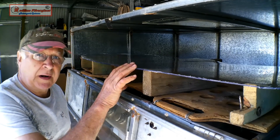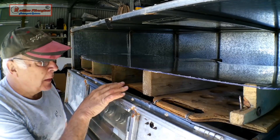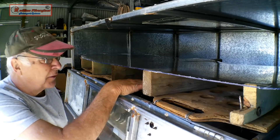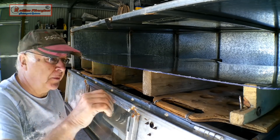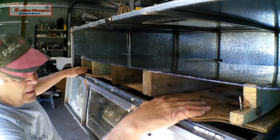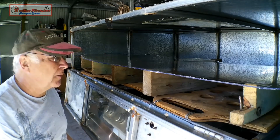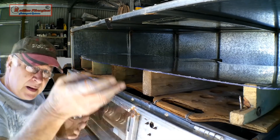I've just finished pre-drying my polycarbonate at 125 degrees for four hours. Let me show you some of the changes in the oven setup. You'll notice I've gone back to the ventilated timber shelf with the holes in it, and I've raised the sheeting up much higher — from about 15mm high on low dowels to 75mm high on fine wood. That gets it away from a concentrated blast of hot air, and you can see I've had no distortion or round bubbling like I had in one of the earlier tests.